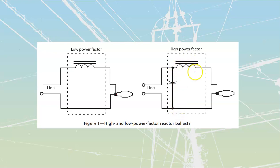At this point, when we first initially start this up, same as what we've talked about before, anytime there's a cap and an inductor and a power factor corrected system, there's always just a brief instant of inrush once we close in. So we're going to have whoosh, a whole pile of current that's going to flood in. We're going to fill the plates of our cap over here.